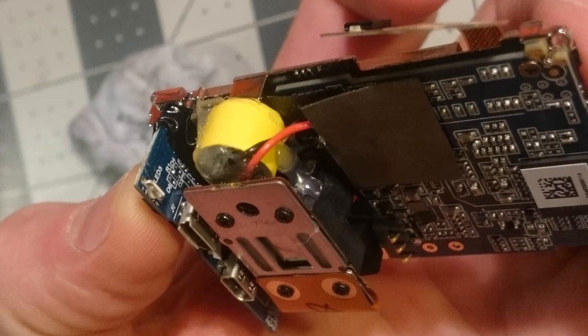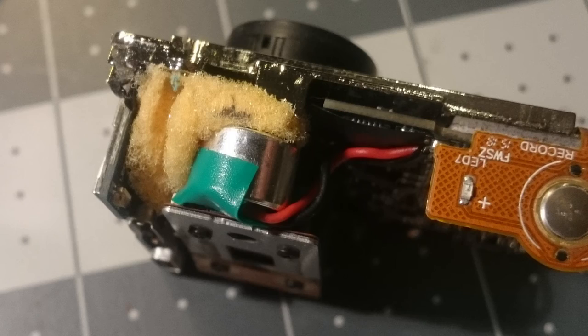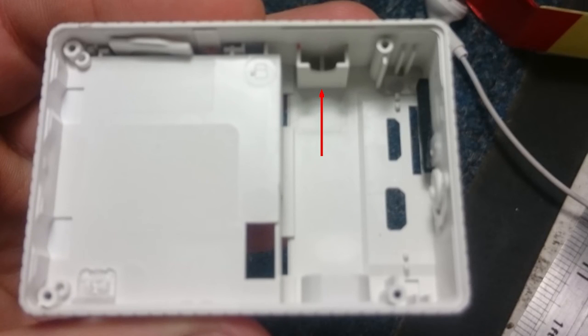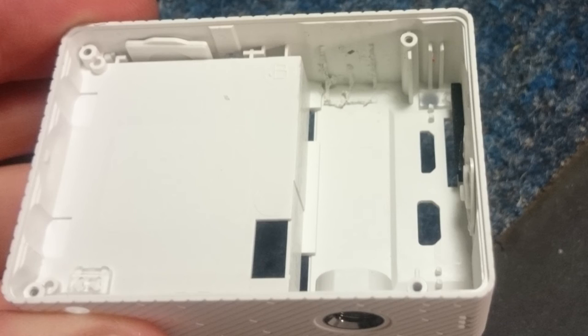From my old mod I also used some electrical tape and put a whole lot of foam in here. I'll also point out that I'm not mounting the microphone facing up like the original — I've got it facing down. This means general audio won't be captured as well and will be quite muffled, but I'm really using this specifically to record my quadcopter and get that nice clean motor sound for the backing to my videos. I also stuffed foam in for more wind dampening. Now before we mount it back in, that little square on the case needs to be cut out so the new microphone can fit in there.